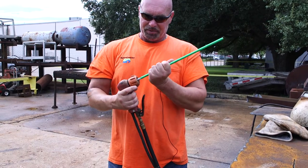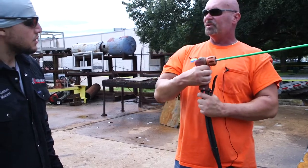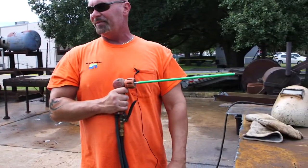So we basically put our rod in, cinch it up, and we're ready to go. The way it works is when you're ready to start cutting, you say 'make it hot,' we'll turn it on. When you touch, it completes the circuit, hit the oxygen, lights up, and tears stuff up.